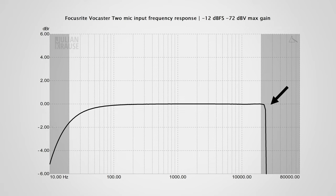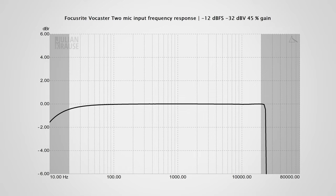In the high frequencies, as soon as we get above the human hearing range the level drops off sharply, because the Vocaster is only running with a sample rate of 48kHz. To be honest, for podcasting and live streaming 48kHz is absolutely fine and pretty much all you need — no complaints there. With the gain turned down slightly, which you would normally use with a condenser microphone, the frequency response becomes much more flat and looks very nice in the audible range.